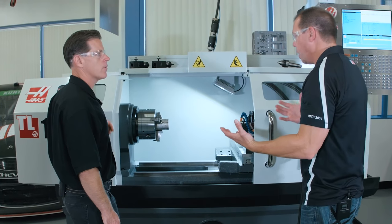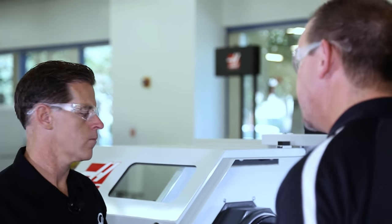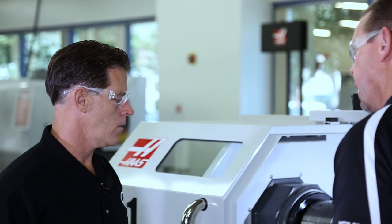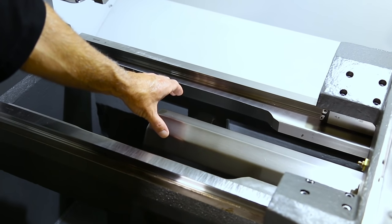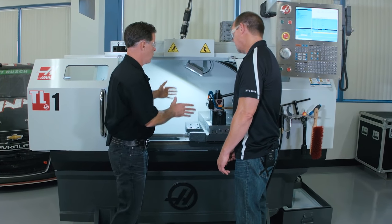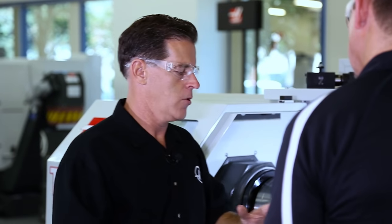While we're on the inside, another big change: this base is totally redesigned. It's a dramatic difference because the ball screw, which used to be at the back, is now in the center of the linear guides. In order to increase the performance of the machine, we moved the ball screw in between the linear guides and moved the linear guides closer together, which gave the saddle a much more rigid stance. Now when you're driving your cutting tool into the workpiece, it drastically improves rigidity.